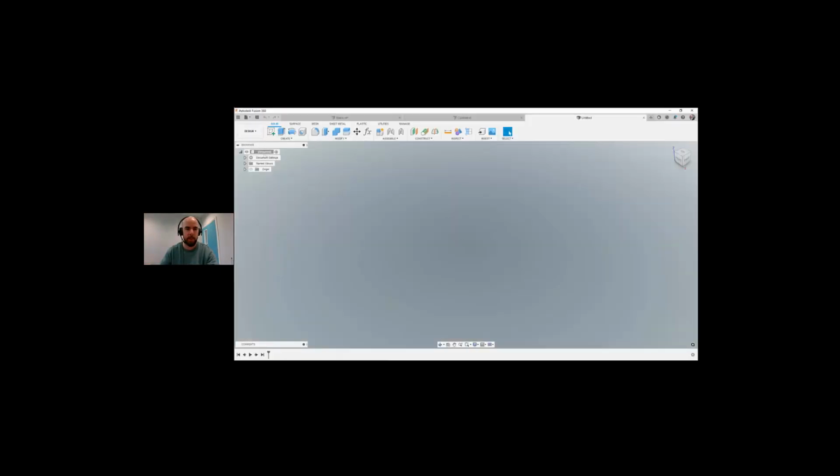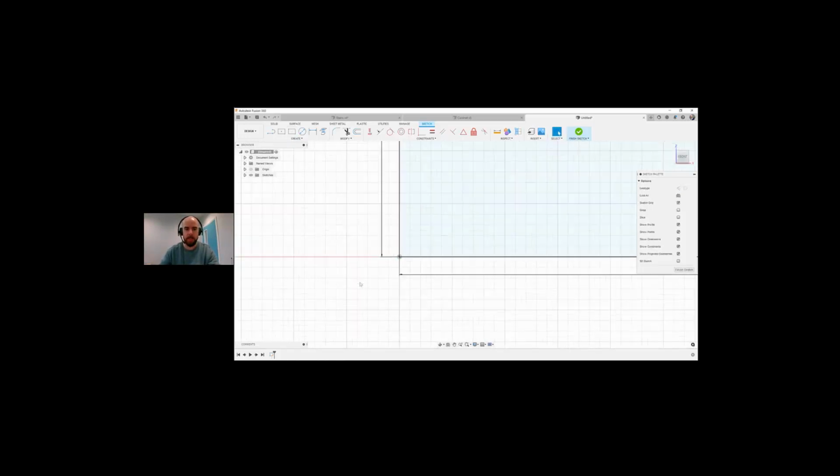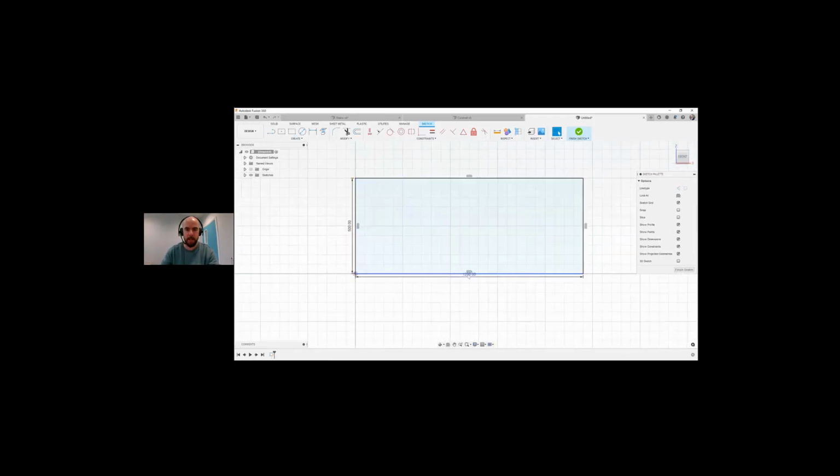So the first thing I want to do is create a sketch. I'm going to create it on the front plane. I'm going to create a 2-point rectangle. And I'm going to put in, it was 1200 in the length, and it was 500 in the height, and press enter. So there we have our length by our height created. At any stage, if I wanted to update these, I can double tap into that. I can update these dimensions very easily. Oops, not 5500.